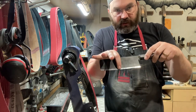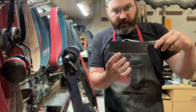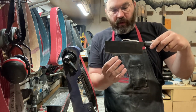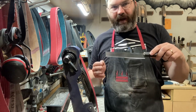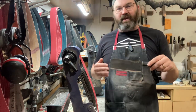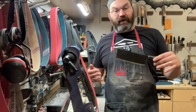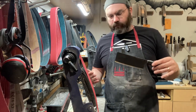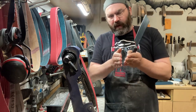where this bevel starts, this little shinogi sticks out, and then there's your edge. So what it does, the edge is basically a wedge. Now, I get customers all the time being like, my new Takeda is wedging. And that's because it's literally a wedge. In fact, all knives are wedge. It just depends on the edge geometry of how much they're going to wedge.